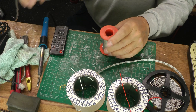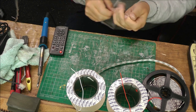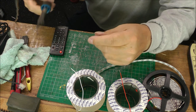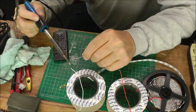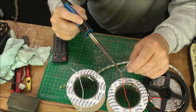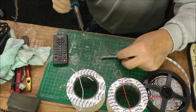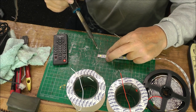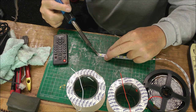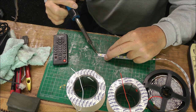And do you know what I hate about this solder? It's too thin. I hate seeing people use not enough solder. And solders come in different variants, temperatures. But this one's... there you go, see? That's all you need. So, all I've done is tin them two up, yeah? There we go. Now, all I need to do, I hope you can see the two little brass ends there, yeah? All I need to do is tin them two. One like that. Doesn't take much. It's only a little blob. There, okay?